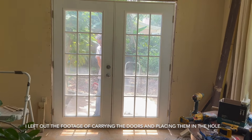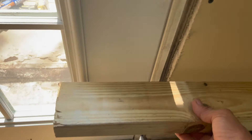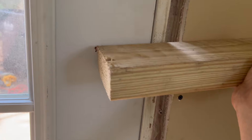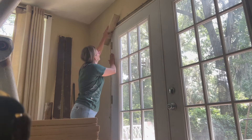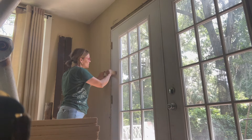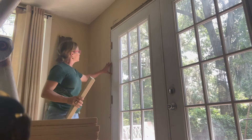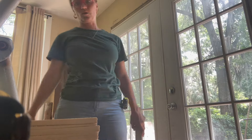Here's what Glenn told me to do to make sure we're flush on the inside: take a piece of 2x4 and put it flush — your drywall and your door frame up together. While he was outside putting the screws in, I held this 2x4 here to make sure the door was flush to the wall. He said, 'Are you flush?' and put a screw in. We did the same thing at each point — flushing the frame with the drywall, not necessarily the door itself.